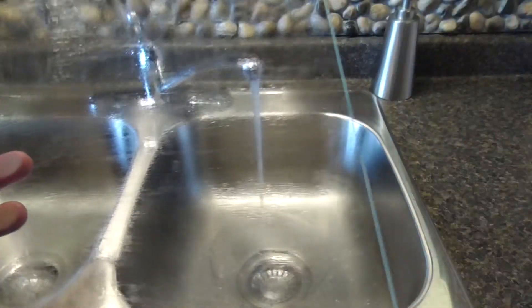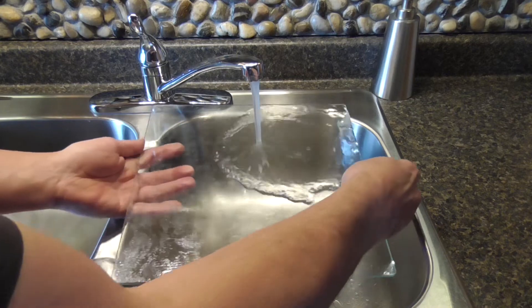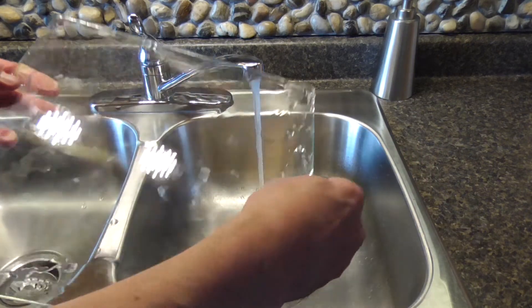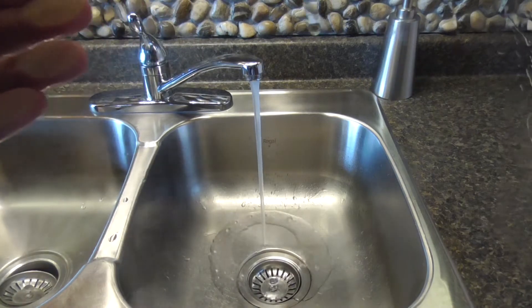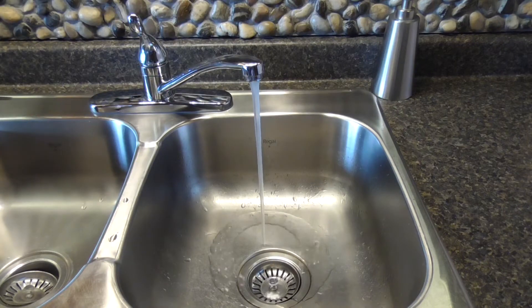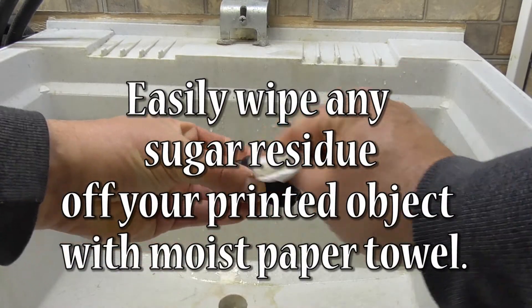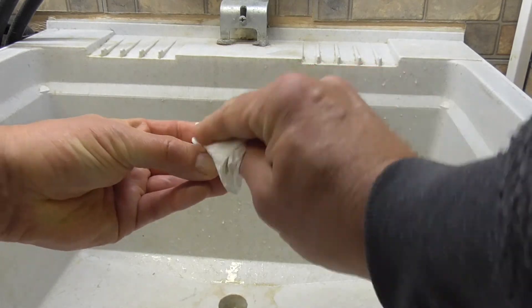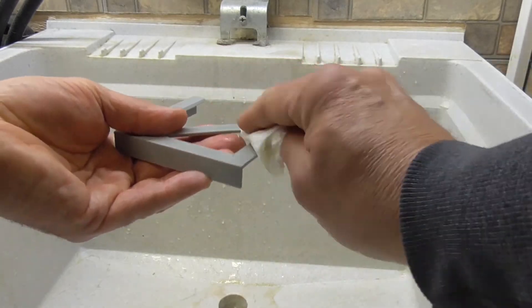And finally, if you would like to completely clean off the glass bed, simply place the glass under slightly warm running water. The glass comes clean almost instantly without the use of any soap, scrapers, or even any rubbing of any kind — the sugar just dissolves nearly instantly. If there is any concern about sugar getting on the print nozzle, I believe there should be no worries, since table sugar softens and caramelizes at 186 degrees and most nozzles print at 180 degrees or higher, so any sugar should theoretically come off with no detriment to the print nozzle. Of course, keep any solutions away from motors and switches because those can't be cleaned easily.